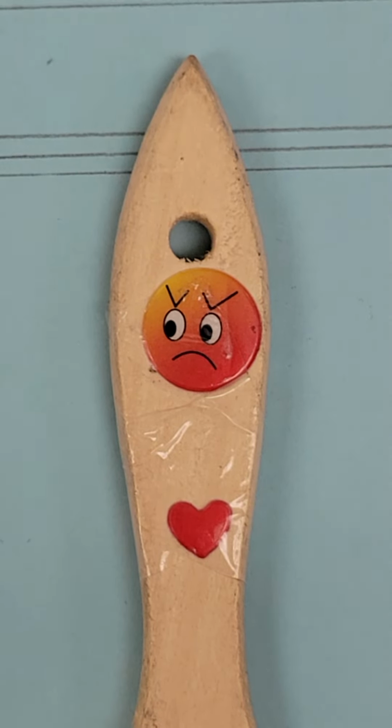All right, so just to run you through this right quick, what I've done is exactly what I had marked originally, right? Did all my mark out, bottom plate, my double top plate, everything else. You might ask, why would I run my lines long? For this particular reason, we're going to start putting more advanced stuff together, like doors, windows, everything. It just makes it easier, I can just erase a couple lines instead of trying to go back and forth and put this in later. So I just did it for right now. It all depends, again, on how you want to approach your drawings. You might not do it this way. This is the way I use to keep myself in order at this particular time.